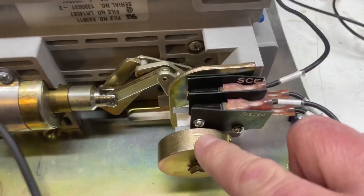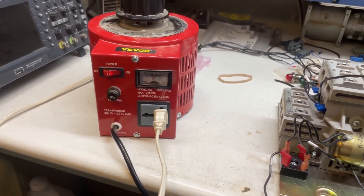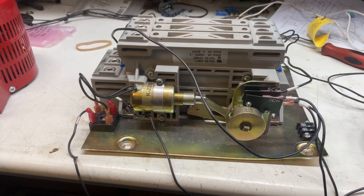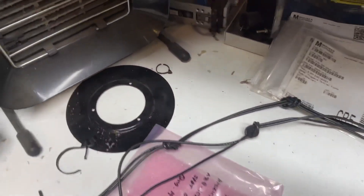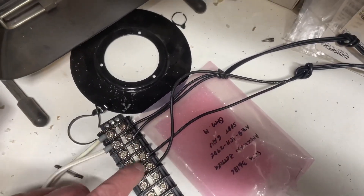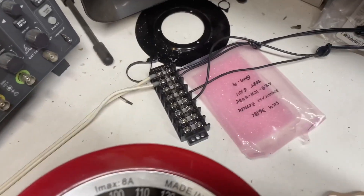I can now go from N to E. I got my power source here. I tried it first with 208 volts and then I tried it with 240, since we're running at 240. So all I'm going to do is activate the switch, and that's how this unit switches. I have to now change my wiring from the transformer over to my utility — this is the power from the generator right now, and then this would be the utility power.